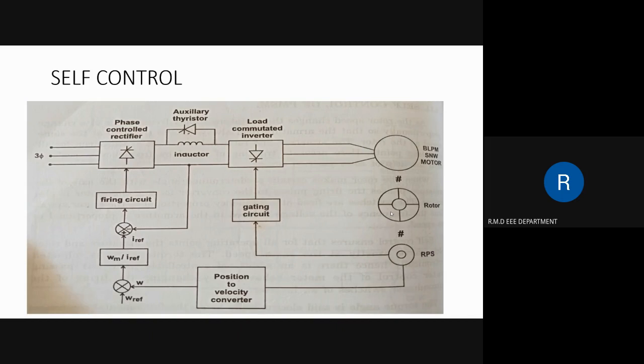When the rotor rotates through a certain predetermined angle, the firing pulses of the converter are varied. These firing pulses of the switches are proportional to the speed of the controller. The torque angle is varied electronically, so there is an additional controllable parameter providing greater control of the motor performance by changing the firing pulses of the semiconductor switches of the inverter circuit.